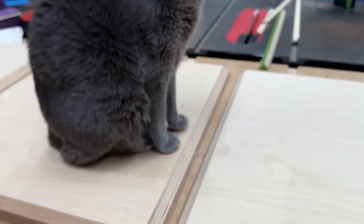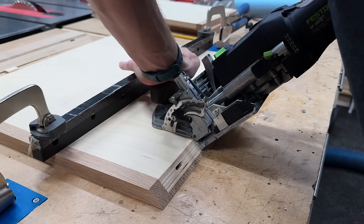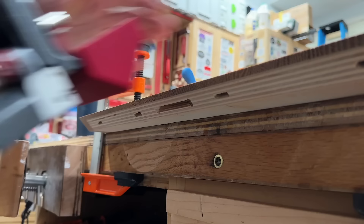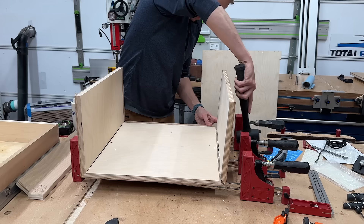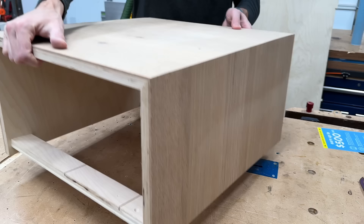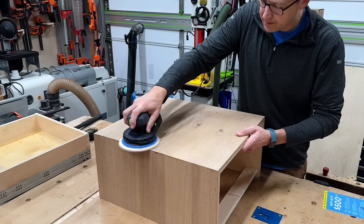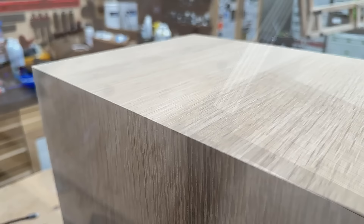In the end, the panels were still cupped, but I ended up with nice, smooth, clean miters. To get the cupped panel to lay flat, I used a clamping caul and some Kreg clamps to clamp it down to my bench and run some slots for some dominoes. And to give myself an even better fighting chance of making sure these miters come together tight, I'm using the Lamello Zeta P2 with some Clamex connectors. A couple hours later I could take it out of the clamps — the miter joints looked nice and crisp with no gaps, which was a big relief.